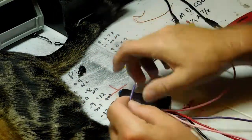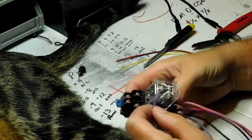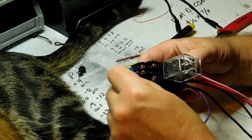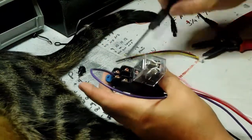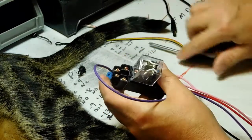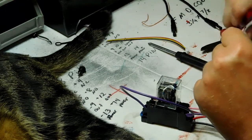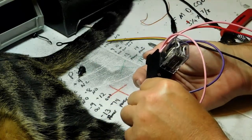You're going to take the jumper wires you stripped and take the negative wire from terminal five to terminal 13 - so you're jumping five to thirteen. Tighten that down. Then you're also going to take number eight and jump eight to fourteen. We're keeping all the positive numbers together - it just makes it easier.